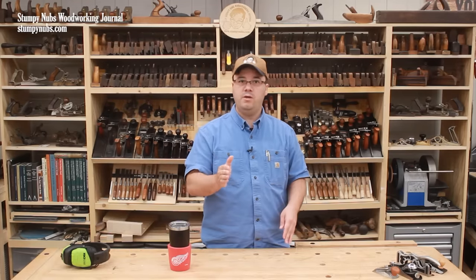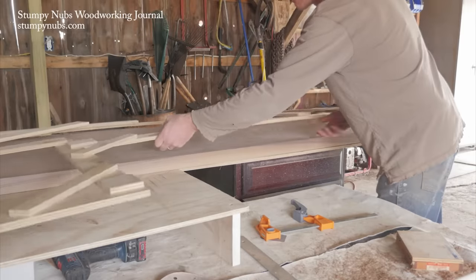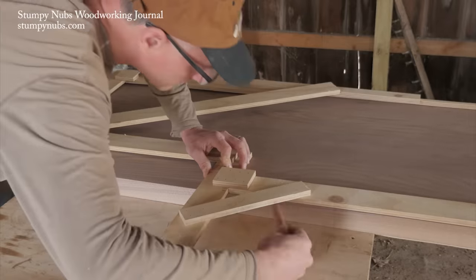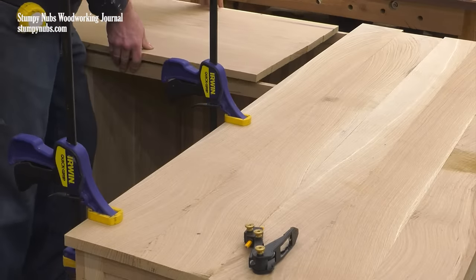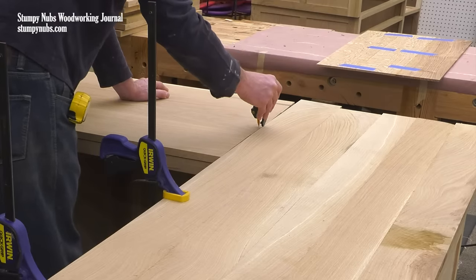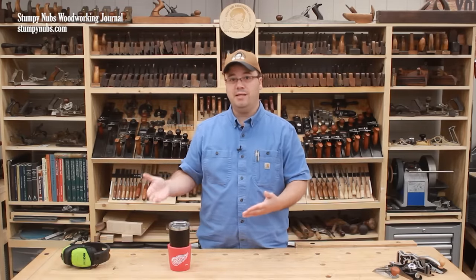One more thing to keep in mind: you should not assume you must cut a perfect 90 degree or 45 degree angle. In the countertop project we made a template from the cabinets at the job site and used it to mark the inner and outer corner of the joint so we could achieve the proper angle. On the desktop we placed the two halves on top of the frame and then scribed the end of the panel that was to be trimmed to the edge of the mating panel. This prevents errors made in the frame or cabinet installation from compounding into the tops as well.